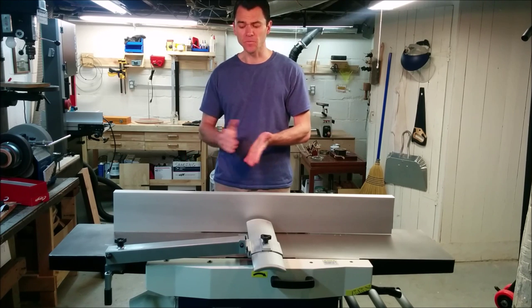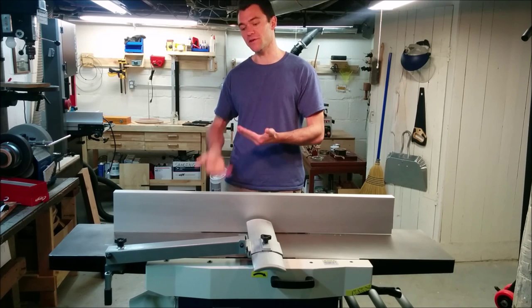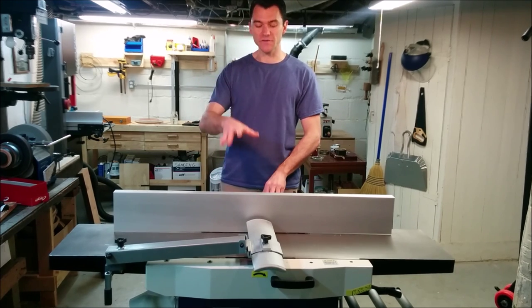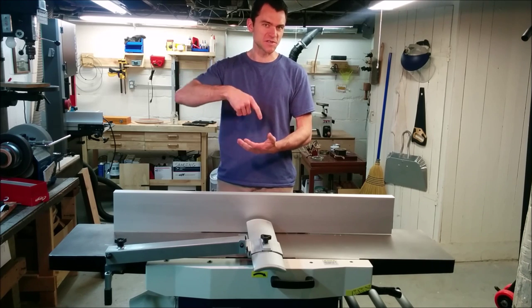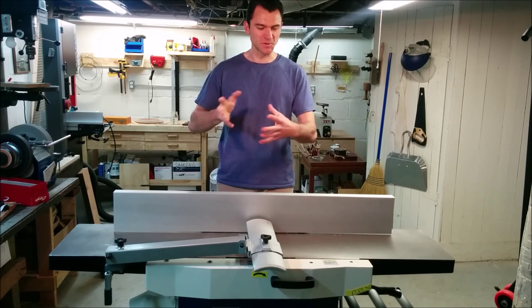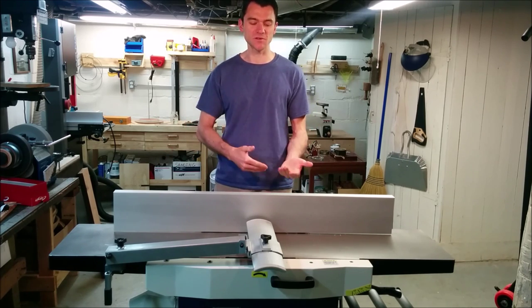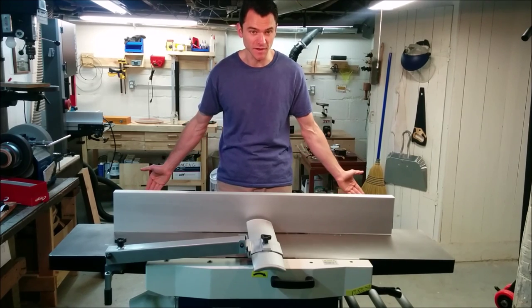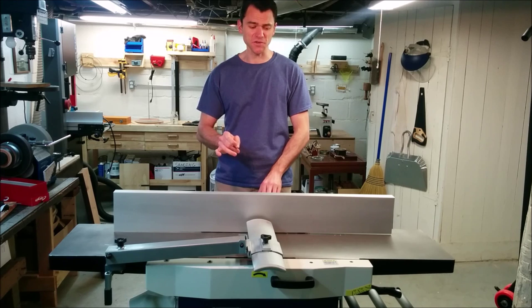So that wasn't great. Secondly, you'll hear this later on in the video when I'm operating the planer table. The main shaft for the planer table just rubs a little bit against its housing, so it squeaks. I re-spread some of the grease up and down the shaft just to make it not squeak, but it came back, so apparently I need to re-lubricate that. That's probably something that should have been perfectly done from the factory.